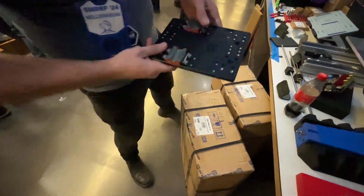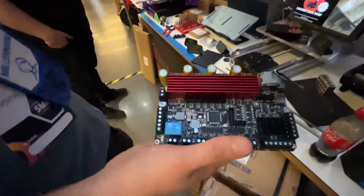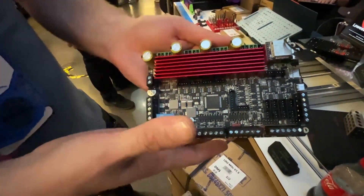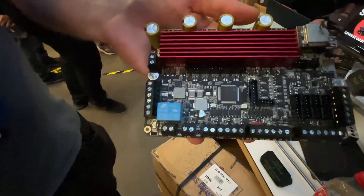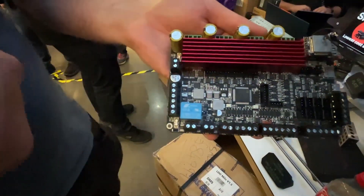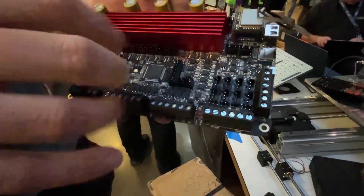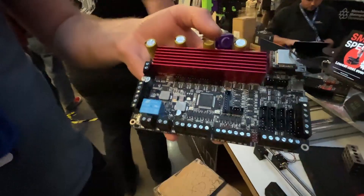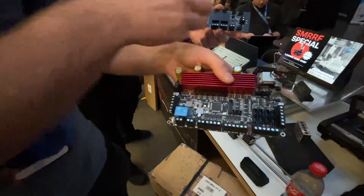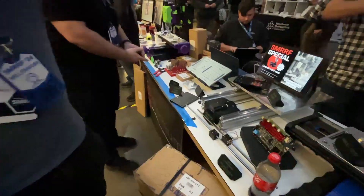Alongside v2 we can also announce that we've been working with BigTreeTech. This is the BigTreeTech SILA — we've been working with them to develop this board from the ground up for CNC. This isn't a 3D printer board like what we had on v1.5. It runs 2160 stepper drivers, up to 4.7 amps RMS and around 6 amps peak. We have specific probe points, specific tool-setter inputs, and all the logic needed to drive the VFD and spindle is built into the board itself. You no longer need a separate daughter board like you had to have with v1.5 kits — it's all built into just this one board.